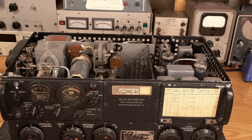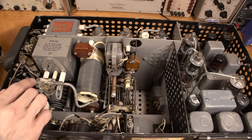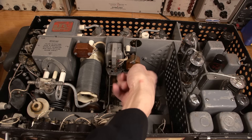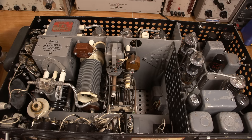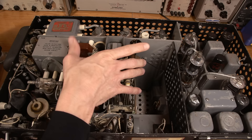I'll move the camera forward and we'll take a look down into this thing. Look at all the RF goodness in here. We have a vacuum relay right here, and another relay over here — contacts on the top and contacts on the bottom. You can see the contacts move up and down. There's a variometer in the bottom — isn't that nice? A bunch of mica capacitors here, and this is the modulation transformer with the two modulator tubes. When you're talking, this is what modulates the carrier.